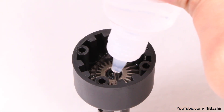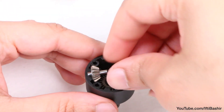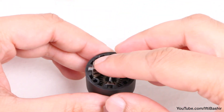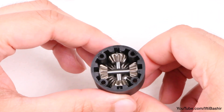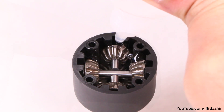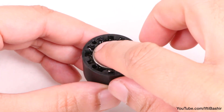Fill with some more oil, just enough to partially cover the bottom gear, before inserting the first gear set, followed by the second gear set, then checking that the gears are all meshed nicely, and topping up with more oil one millimetre below the top of the cup, before popping the final gear on top.